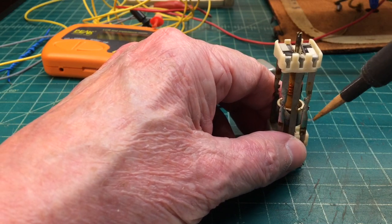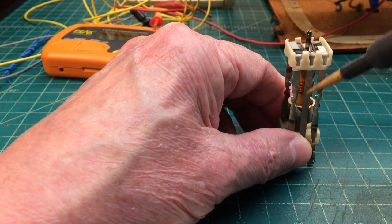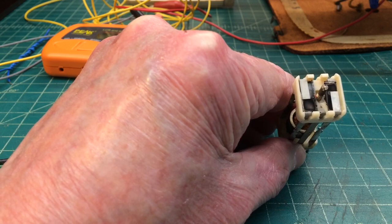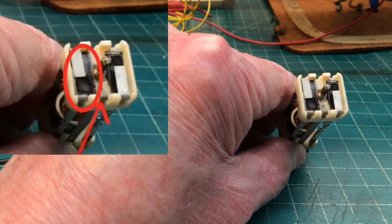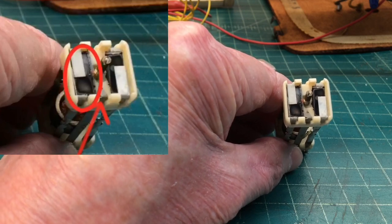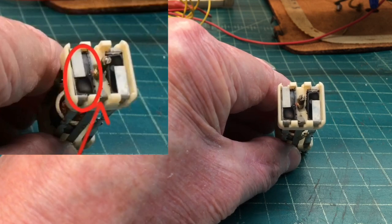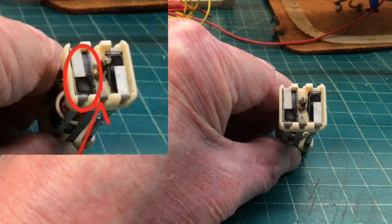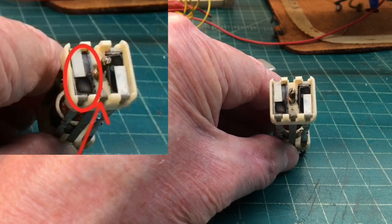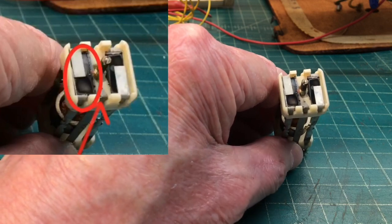As you can see, this transformer has five legs on it. This center position here is the side that I'm interested in — that's where the 155 picofarad capacitor resides. The purpose of that capacitor would be to shunt the 455 kilohertz signal to ground, and of course some additional filtering is done post this circuit as well.